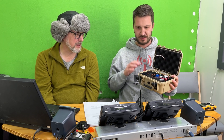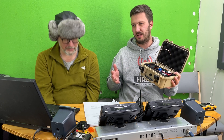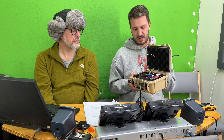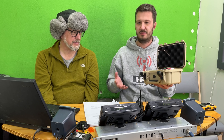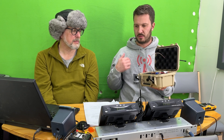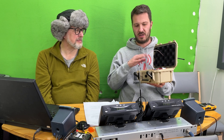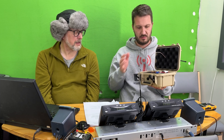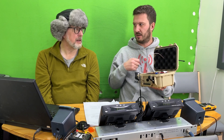If you're on the two-metre frequency and you're right on top of it, you can unscrew your antenna — and this really goes for any fox transmitter. Go to a harmonic, because the problem is it's still way too strong. You could be several metres away and can't see it visually, but you'll still hear it. What you do is tune to the second or third harmonic, which is about the 70-centimetre band, and because of the deviation of the signal, you probably have to add about 5 kilohertz to the exact third harmonic frequency. That makes it a lot weaker and a lot easier to find.